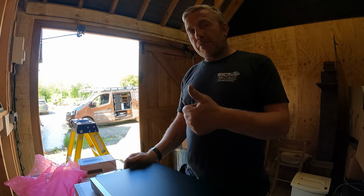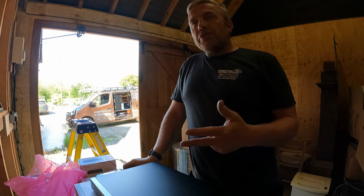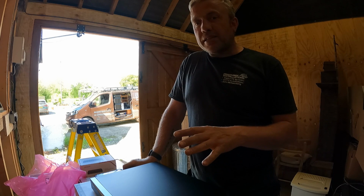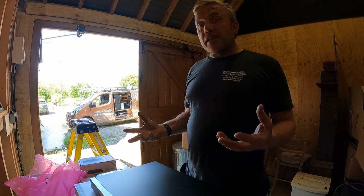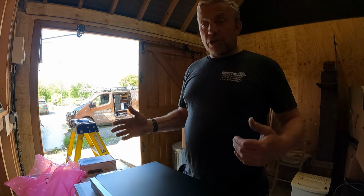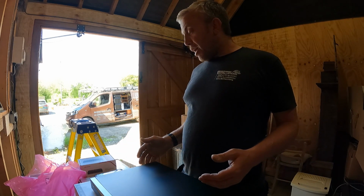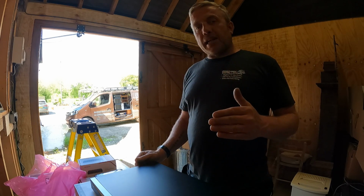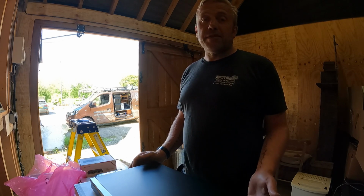It all depends on how many cameras you're recording, how long they're recording, what resolution they're recording, the frame rate per second, and the quality of the image, that sort of thing. That all matters to how much it'll eat up the memory on the hard drive. So we've got 9 cameras here, all pretty high-end stuff, very high quality. So I needed to get a bigger memory because I want it to last longer, so they've got a good amount of time to act upon something happening before it starts overwriting. So something like a 500 gigabyte or a 1 terabyte, 1000 gig hard drive, that's sort of the base level. He's gone for a 4 terabyte, that's 4000 gigabyte. That's big for a CCTV system.